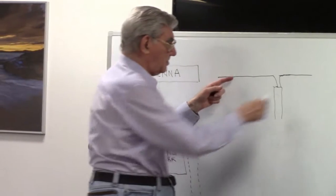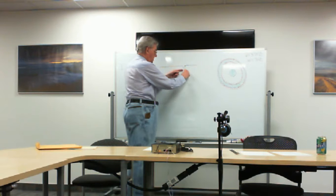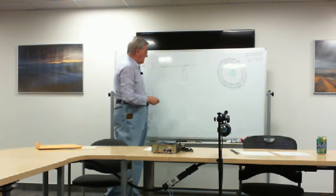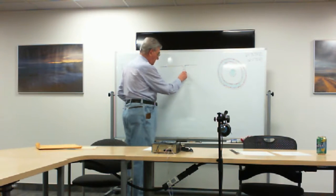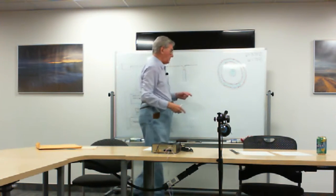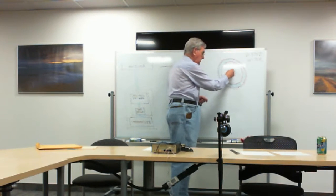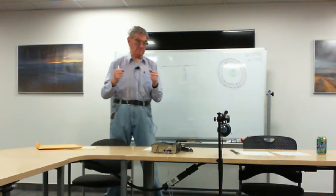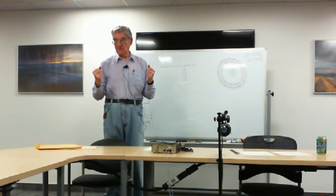These two currents will not be the same. So, within the coaxial cable itself, the current flowing in the center conductor and the current flowing on the inner surface of the shield have to be the same. It's the nature of the beast.